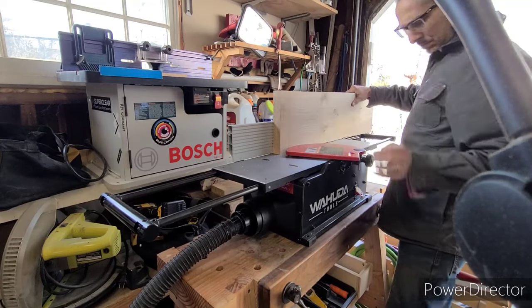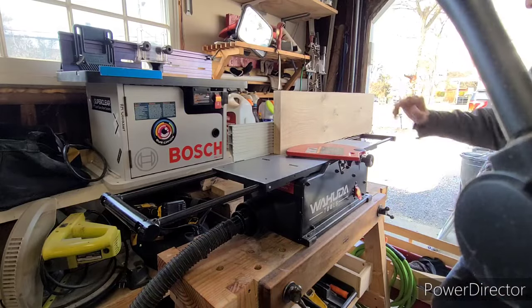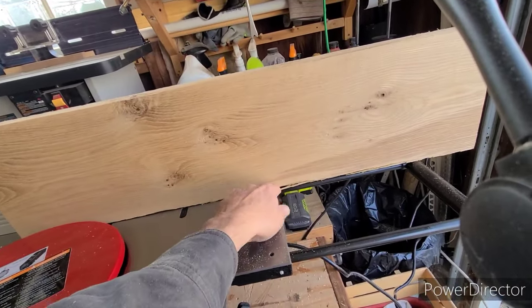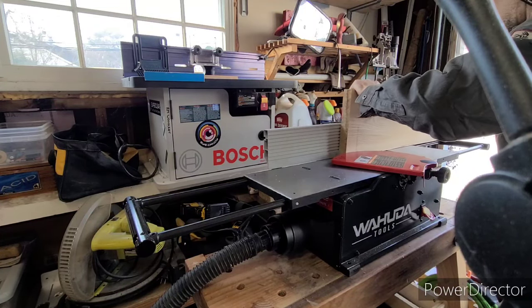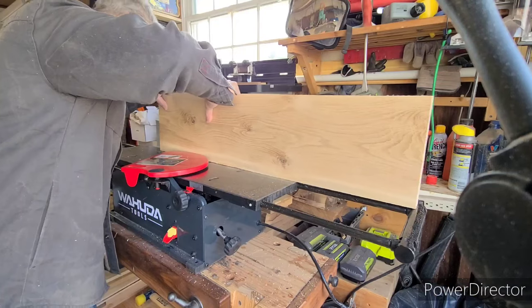So I just got that joiner and this is the first time using it, and right now the issue is, see that little split right there? So that was holding me up. The grain on the end there is kind of running in both directions, so there was no good way to run it through the joiner. But once I got that little piece off, it worked fine.